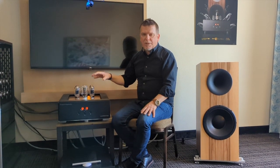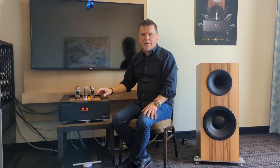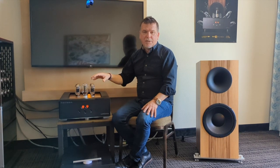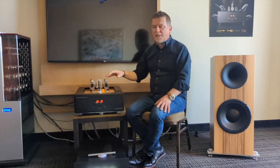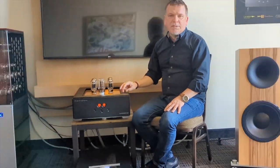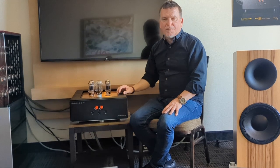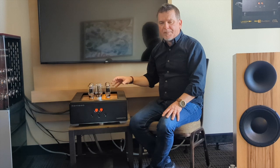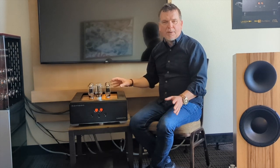So everything we use in this DAC is a traditional linear power supply, meaning that we need a transformer, and we need a bridge, and we need a capacitor filtering network. The transformers, to avoid humming, avoid any kind of overload, avoid any kind of stress or distortion of the sine wave produced, are oversized. So we have 3 power transformers inside. Each of them is roughly around 100 watts. So we have 300 watts of potentially available power, even though we only use 65 watts at the end of the day.